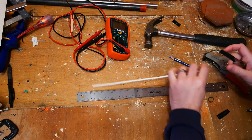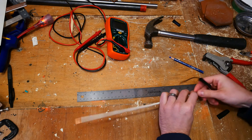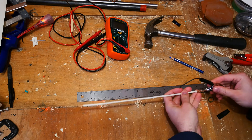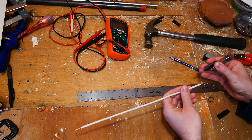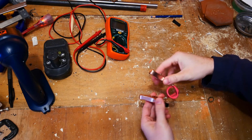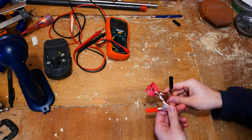Next, we've got these connectors — it doesn't quite fit through the hole, so we're going to crimp it and then solder it together, and do that at both ends. Once that's done we'll have our connectors to plug into the circuit. With a little bit of movie magic, we now have copper clamps instead of aluminium, and the wire is red — I already built these so I went out and got them.